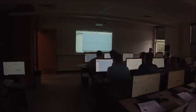All right. We're going to use the dimension tool. We're going to use these two dimensions that we just got from our layout sketch. We're going to put them in here. So click on the center point of your pin circle and the center point of your pivot circle. So we're going to have to create a horizontal dimension and a vertical dimension. Doesn't matter what you do first.